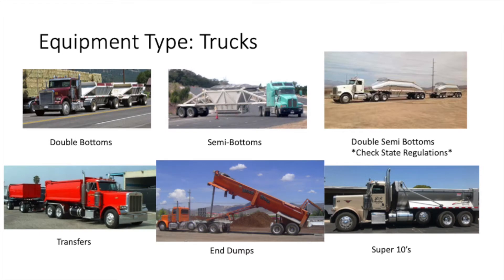Finally, we have trucks. Trucks are very important for both rough and fine grading — in particular fine grading for placing base rock, as well as dirt import-export operations that cannot use scrapers because they have to cross public roads. At the top left, you probably see one of the most common types, which would be double bottoms. They're called this because they drop their material in windrows from the bottom of their trailers. Just right of that, you can see a semi-bottom, which is basically the same thing but one larger trailer. Just to the right of that is something not very common in California, called double semi-bottoms, used for mass dirt moving operations for longer distances — usually over a mile — which is typically where the line is drawn between needing scrapers or needing trucks. Below that, there are three more truck types we'll cover in detail in future videos.